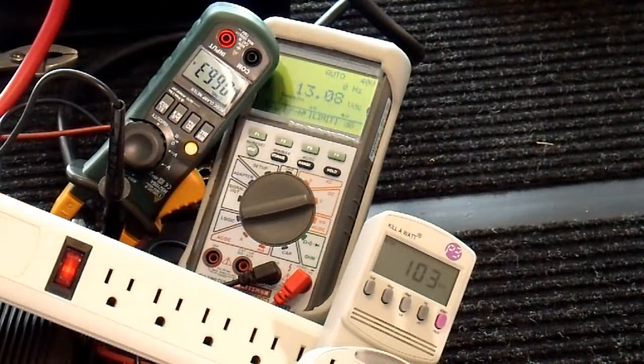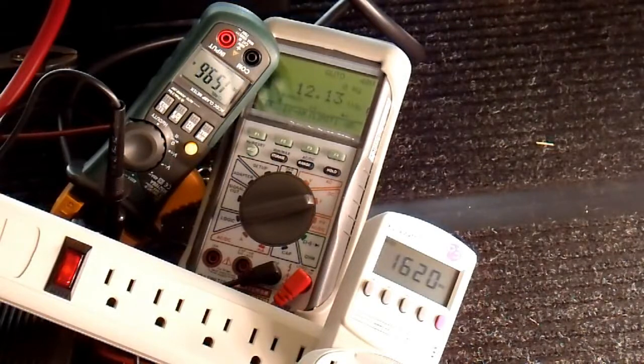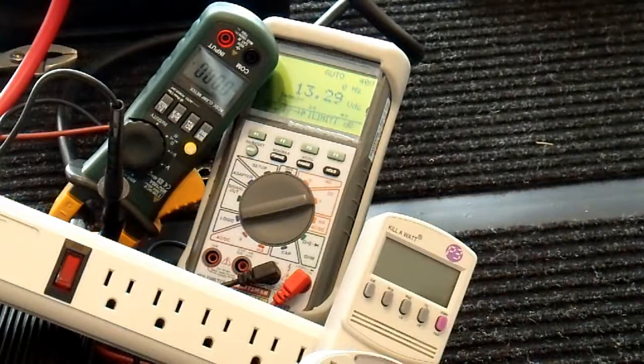I can't go higher than that. So there is about 1,000 watts — I have the heater going and one of the light bulbs. I'll just keep screwing these things in again. Eight. Nine. And if I go any higher this thing will shut off due to an overload condition, but that's good enough for this 1,500 watt inverter — it actually does quite a bit more than that. It's probably getting pretty hot right now, so I'll shut it off, but it does get warmer after a while. I'll take these results now, watch this video, and put it in a spreadsheet.